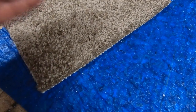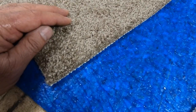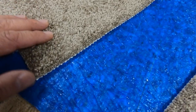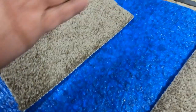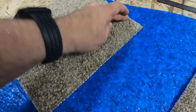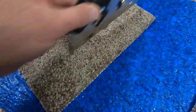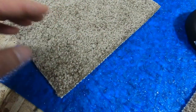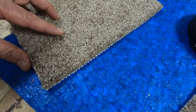To help understand the difference between top row cutting and straight edge cutting a carpet in preparation for the seam, I want to show you the differences here. With a top row cutting method, you're going to find a row in the carpet which is between the rows of nap. Once you find that, you're going to take your top row cutter and cut it in between those rows. I have beveled the edge of this carpet back with scissors to expose the edge of the backing to show the difference — this piece has been row cut.